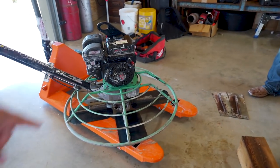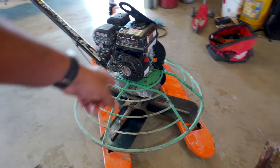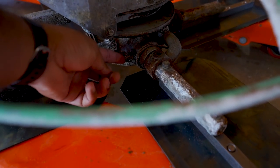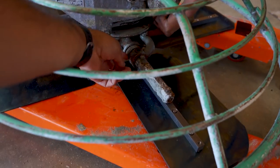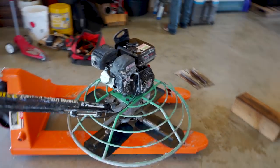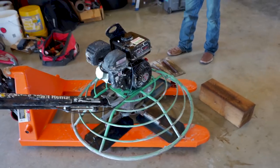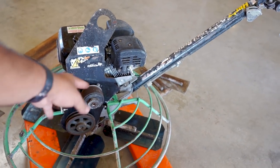Now we've got to grease all the fittings. Go get a new belt for it too — we've got to change the oil. Put some grease in all the fittings right where all the blades are, the arms. You see it? It has four — make sure they all have plenty of grease, not too much but just enough, so make sure these arms move freely. That's what matters — those arms need to be able to move. Whenever you pull the pitch handle, see they all work pretty good. Make sure you get some grease on all of them. Once you're done, make sure you clean all the grease off the bottom, otherwise it's going to get all over the slab.